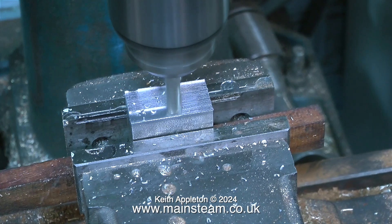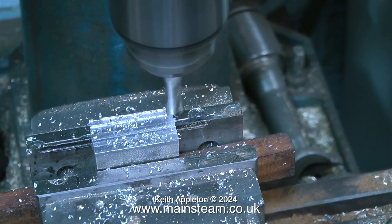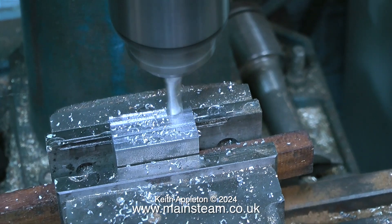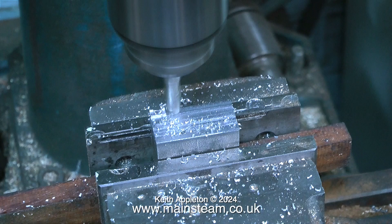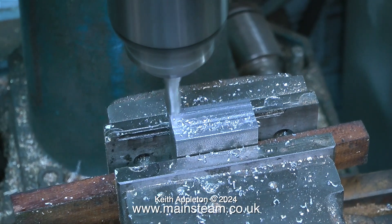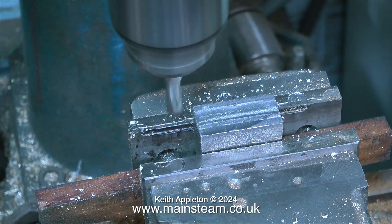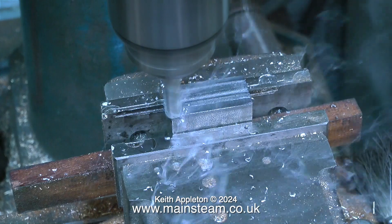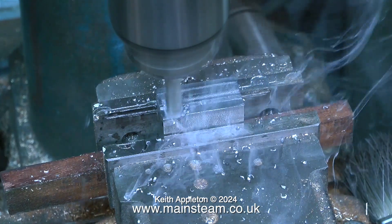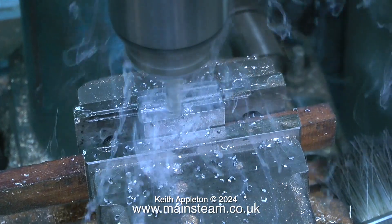I've just cut the block from this piece of bar stock. The milling cutter is in my very old Jacobs chuck, which is very stiff and never works loose — it's just convenient to clamp it in there. I could use an R8 collet or even my Clarkson milling chuck, but for general bits of milling this is perfectly acceptable. I just put the milling cutter into the drill chuck and tighten it up and it never works loose.